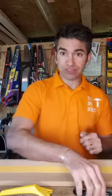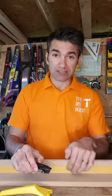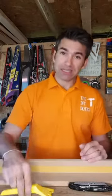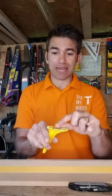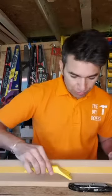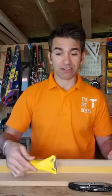The first thing you need to do is get rid of any old sealant — you can't seal over seal. Use a blade to score down the corner, making sure you don't damage anything, then pick an edge and pull the whole thing away. If anything's left, use a glass scraper — it has a Stanley blade on its edge, so it's a really sharp scraper that removes residue without damaging the enamel of the bath or tile.